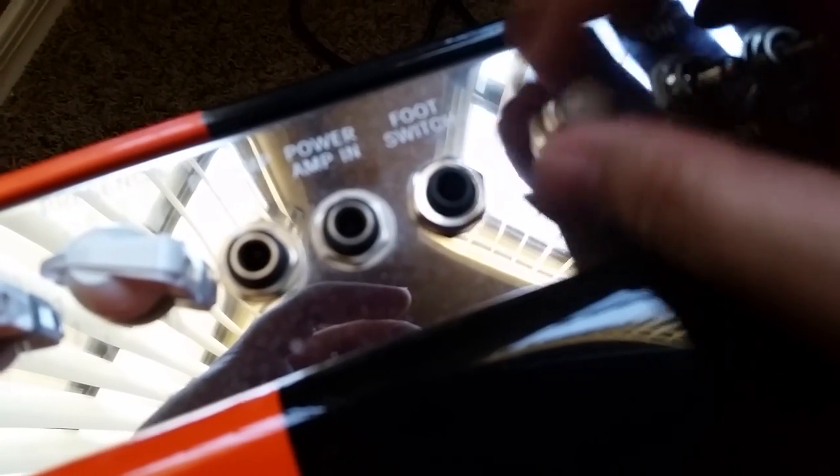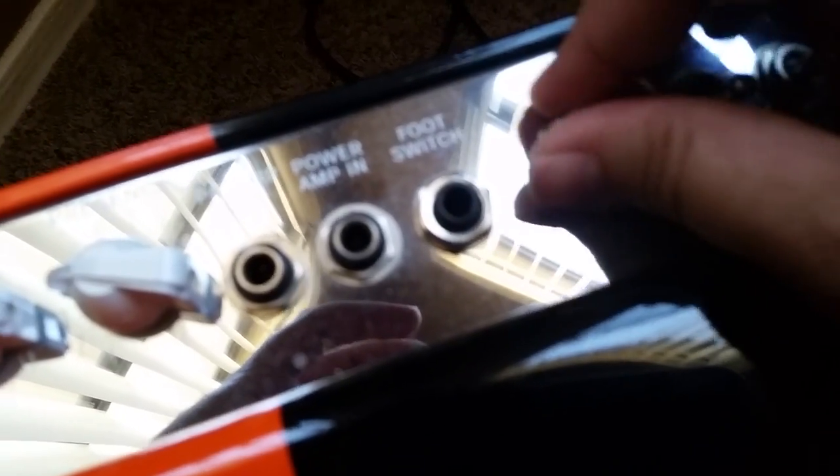On mine, just like all my amps, I kind of mod the light. This is a white bulb lens, and what's in there is an LED light. You can buy these online for like $2 — pops right in. The LED is brighter, lasts a thousand times longer, and you can change the colors. I'm using a white bulb because it matches the knobs, and then a blue LED — it's so bright it lights up the room almost.